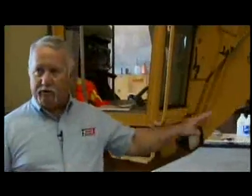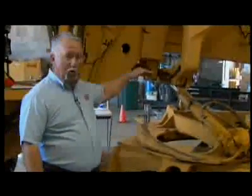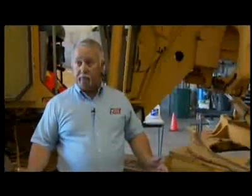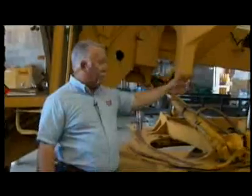Any time you're going to be roading this machine, make sure you address all the safety requirements: you're in your seat, wearing your seat belt, you've got flashers on, you've got your slow-moving vehicle sign on the back, or you're running with an escort. Check with your appropriate area to find out what is required when you get out into the field. Also of concern during walk-around inspections is the way we're carrying our mold board setup. Inspect all the hardware to make sure it is safe to road with, because you're going to pull that mold board up high and tuck it in underneath the machine while roading. If you have any problem with those attachment points, it's not going to stay there — so make sure all attachment points, especially going down to your mold board area, are good and operating properly.